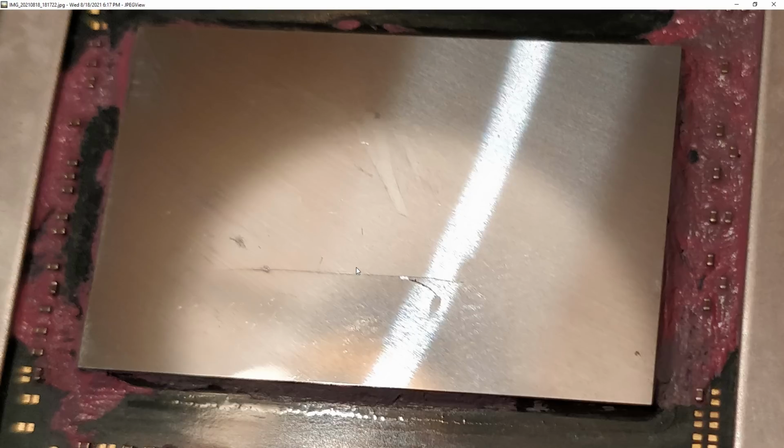If you intentionally wanted to blow up a chip, all you'd really have to do is connect 12 volts to the output of the VR. Actually, connect a very high voltage to the chip, disable the thermal protection, and then just turn it on. Because if you heat up a chip enough, eventually it'll shatter, and during the shattering process it'll probably send shards of silicon flying everywhere. But since this was clamped under an LN2 pot, it didn't do that. I imagine without the LN2 pot in place, it would have been in a bunch of little pieces instead of just having a crack in it.